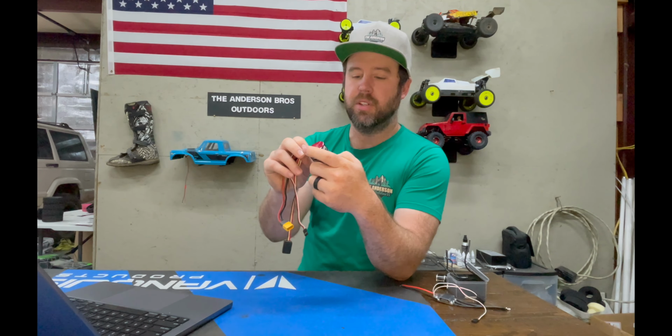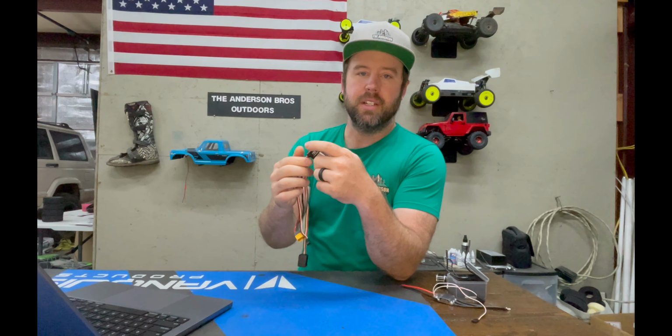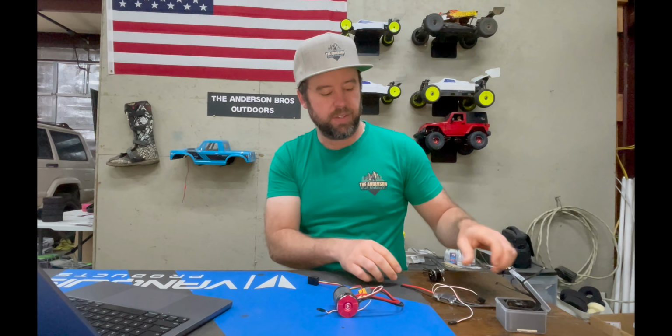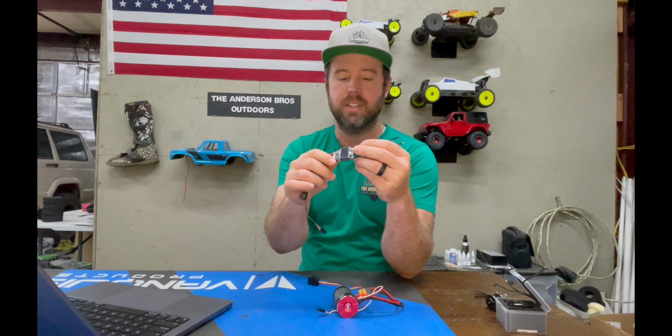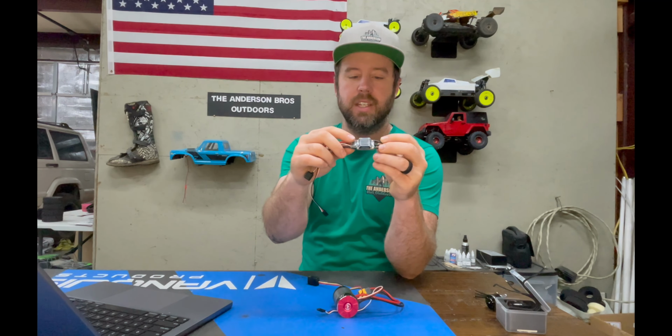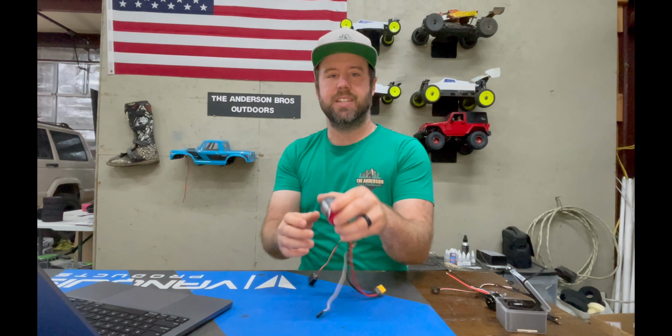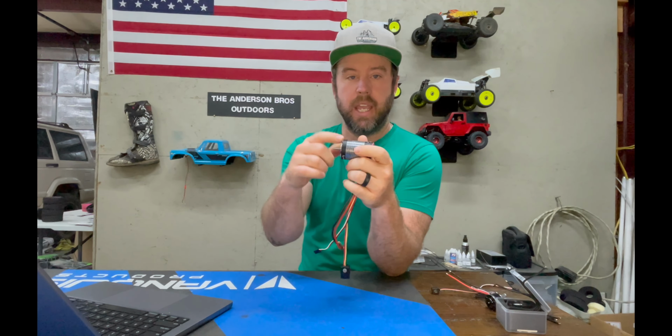In today's episode, we are going to be throwing another motor on the dyno. To date, we've been running a 1400 kV drone motor like this. It's called an outrunner because the outside of it spins versus the inside, with different ESCs. We've tested the Castle ESC, tested the Rhino 40 amp ESC. However, today we're gonna test this 2-in-1 Fusion to see what the difference is between that setup and an all-in-one